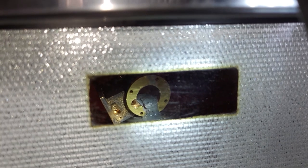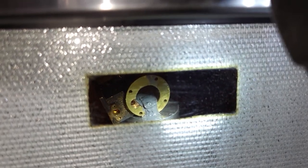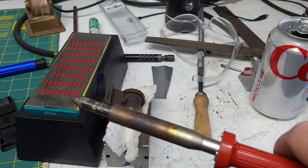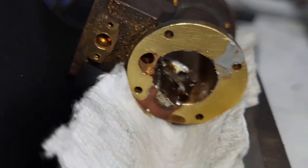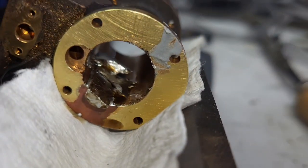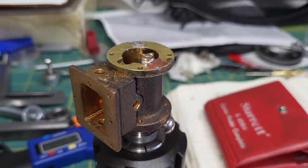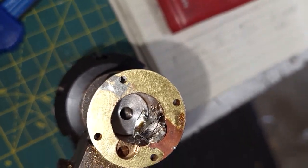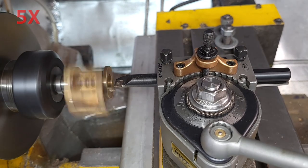And that's the kind of horrible mess it turns into. Up at temperature — it's not melting. There's just too much thermal mass in there. So I went in with the big soldering iron and finished it off, and that did get it to stick. Everything flowed, all the holes are filled, and we have a horrible gunky mess. Now we stick it back on the mandrel with a screw on that convenient 5mm hole that's still there to hold it from spinning. And we've got enough clearance to go down 0.64 of an inch and bore it out.